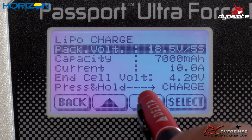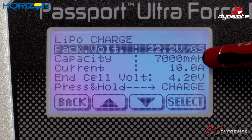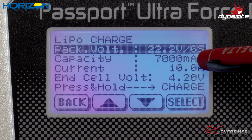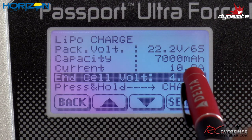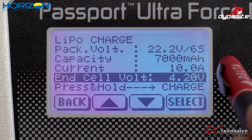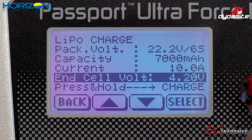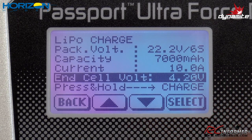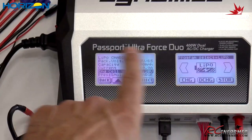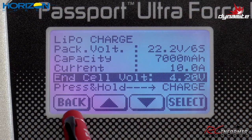Selecting charge: you can see the parameters already set. Pack voltage — you select the line you want and use up/down arrows to adjust, then press select to change the value. I've set it to six cell, 7,000 milliamp, maxed out at 10 amps for a full test with two six-cell 7,000 milliamp Conexus packs. You can set the end voltage — 4.2V is where you want it to fully charge. To start charging, press and hold the bottom charge line. Both sides of the charger work exactly the same — both set up to charge two separate batteries the same way.